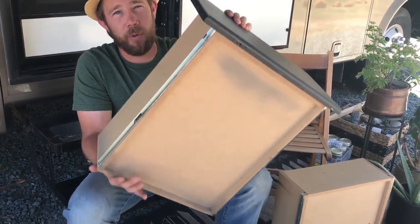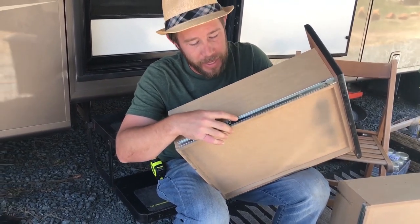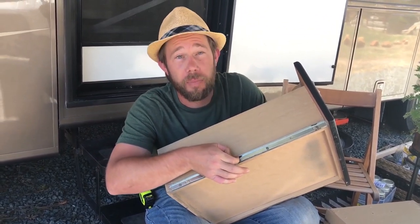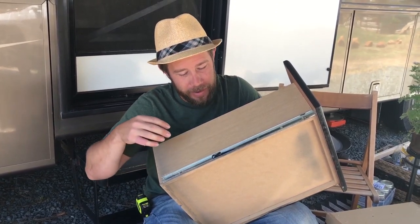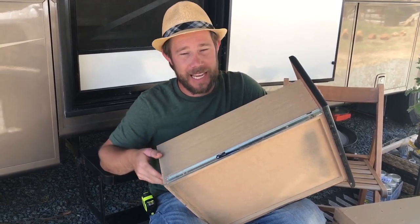All right, now that we got the sides all wrapped up, we're gonna go ahead and move on to the kitchen drawers. Now, we're starting with the larger ones, which are on the far right-hand side. And there's a couple things I wanna note before we go forward. Number one is that when you're taking these out, you're going to notice that in your sliding brackets, there's these little black things. Now, depending on how they were installed, some of them are upside down, some of them are this way. But what you want to do is pull up if it's on the downside and down if it's on the upside. But you want to pull both sides at the same time and then release. I know that when we first started taking drawers out a long time ago, it was really tricky to get that figured out. But anyway, that's a side note.